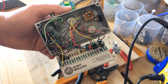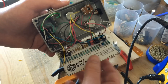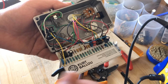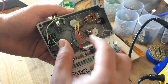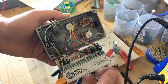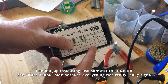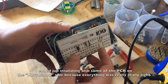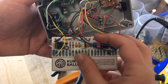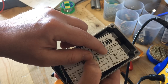At this point I've connected pretty much everything — what I'm missing is just the volume mod. I connected all the pots to their respective numbers, being careful not to mix them up, which is really easy to do and happens to me quite a lot. I'm not too worried about this extra wire here — because I chose this really small enclosure, there's no support for the PCB, so this extra wire is going to push the PCB against the back of the pedal and keep it in place. I'm going to insulate the back of the pedal with some electrical tape. For the mod, half of the volume pot is connected to volume; the other half I'm going to take pins one and two and connect to exactly these two points.